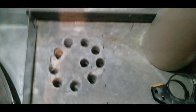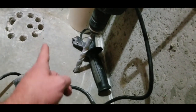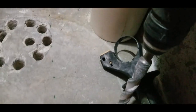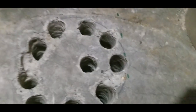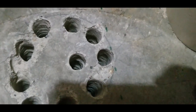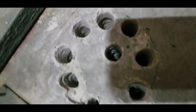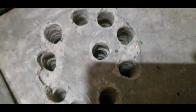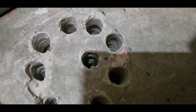I drilled a test hole here because we're close to the wall. Here's the foundation wall, and there's going to be a footing up there — you see that dotted line, that's where I'm guessing the footing is. That's why I put the holes on the left side of the footing. I made it about eight inches away from the wall to try to avoid hitting the footing, because we want to get the pipe down into the dirt below the concrete. The footing would be much thicker and deeper and really hard to get through, but I think we successfully avoided it. I'm going to take a chisel bit and chisel out the spots between these holes until we can reach in and dig out some dirt to create a good suction spot for the radon.